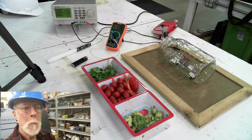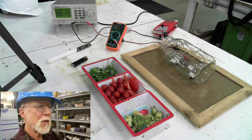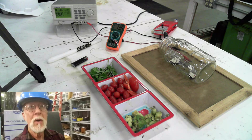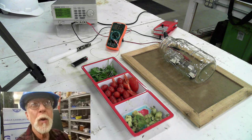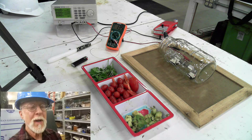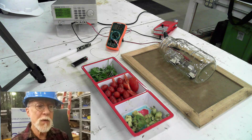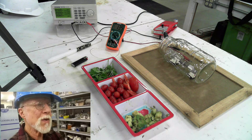Well, I'd been using ferrules for vacuum work, and I was familiar with how they operated. And I thought aluminium is a soft metal, and it's going to smear. It's going to move under pressure, especially with a very shallow taper, a wedge shape, a cone that's inside of the nut as you tighten it. It's going to wedge that aluminium against the ceramic. And the ceramic is very hard. It's not going to go anywhere. And if anything moves, it's going to be the aluminium. So the aluminium metal, being soft, is going to be forced into the pores of the ceramic to such an extent that it will actually be a weld, a pressure weld.